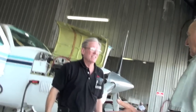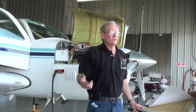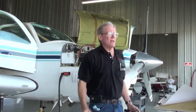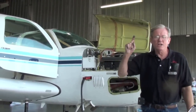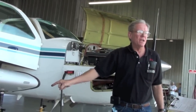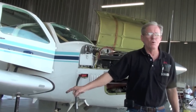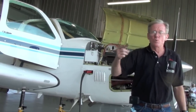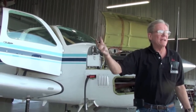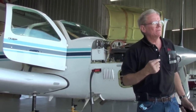You fly 180 knots, you know? Right. Exactly. You have to crank it in the back and stop. If it stops at a quarter of a turn where it's supposed to, the door should not be hanging open. But you must rig the airplane with 28 volts on it, not the battery. If you rig the gear system with the battery, it will never, ever be right. Because what is the alternator doing? 28 volts, isn't it? You have to simulate the same voltage.